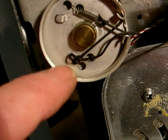Begin by putting the tuner capacitor all the way in the closed position. You see here the plates on the tuner? Make sure they're all the way closed. That's the 55 position, the lowest end of the dial. Then take your cord and hook it onto this tang right here, this little clip.